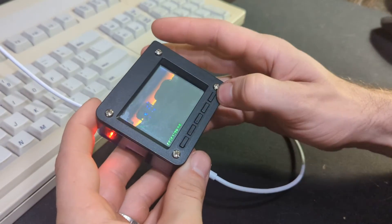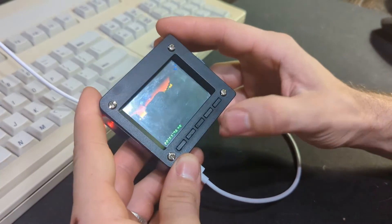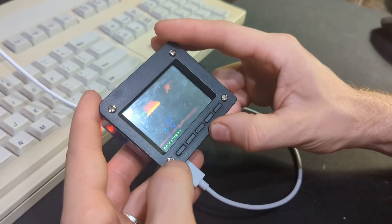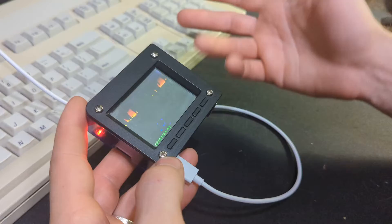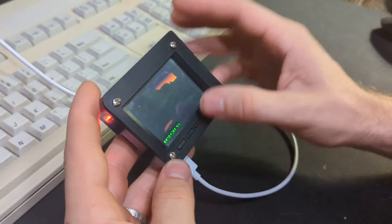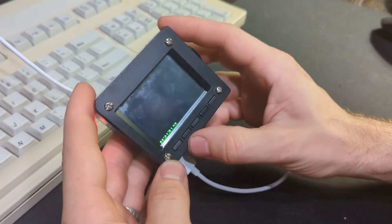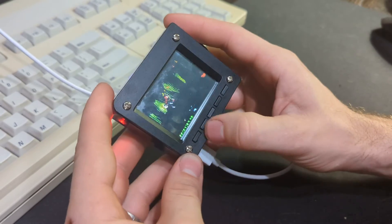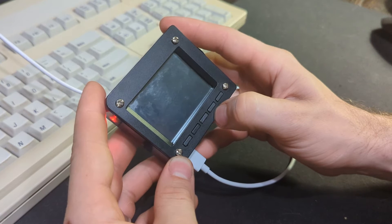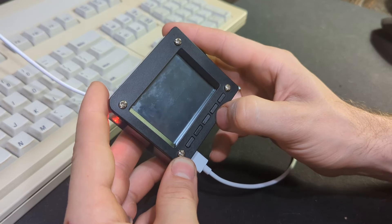Another cool thing — this comes with some GPIO buttons. What I've done is used the GPIO keys options within the config.txt file to pretty much treat these as keyboard keys. Luckily, the Pi Video Looper script has a few shortcuts you can use. For instance, we don't want to watch Donkey Kong Country — I've set the second button to be a skip button. There you go, it's shut that down and it's going to be loading the next video in just a moment.